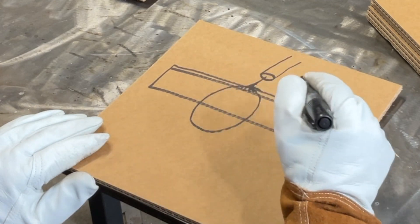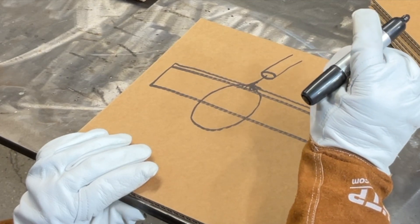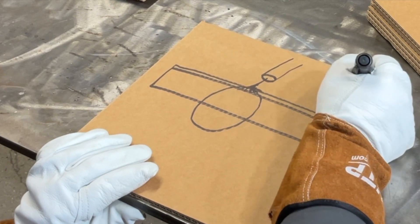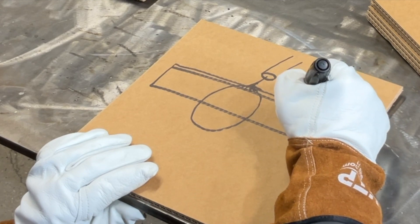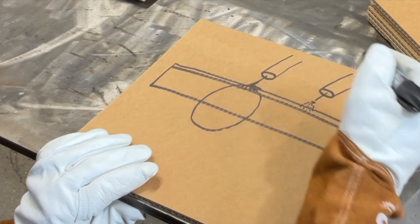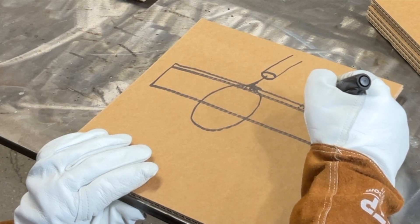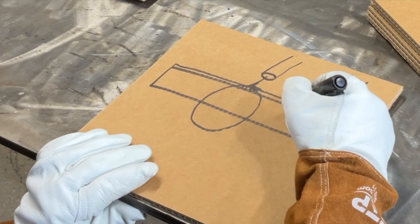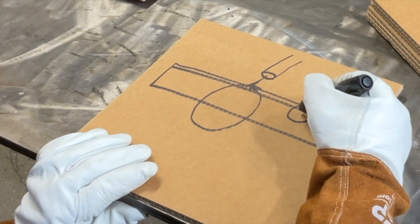So this is where pulse shines. Remember the droplet is very hot but very small. The droplet that is formed in pulse is a lot smaller — still very hot, but it's a tiny droplet going into this interrupted stream of tiny little droplets. As it hits the surface it loses most of its heat and energy to break open that oxide layer, and then your penetration into the base material is a lot less.